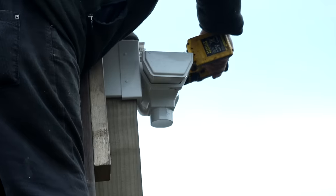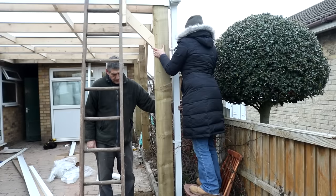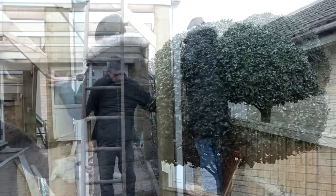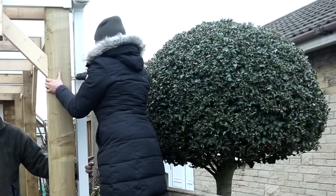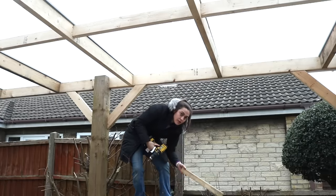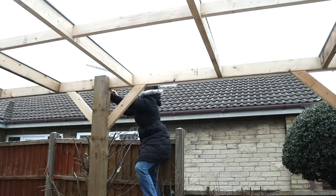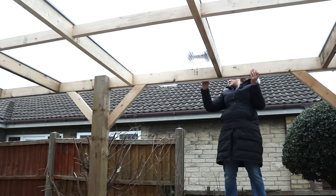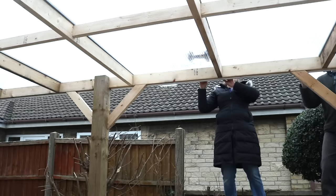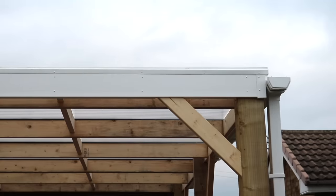Next we needed to sort out some guttering, because who wants to get dripped on. The first thing fitted was the downpipe piece — after cutting a really long piece for the soak away, I screwed it to the post with brackets, then worked our way backwards. It was tricky with trees in the way, but I screwed the brackets to the side. If you want to see how I've done that in the past, I'll leave a video link below. Rather than marking everywhere, I used a wooden batten cut to the same length as a reference point. Meanwhile, my dad added another trim piece on top of the front fascia of the carport, which looked rather cool.